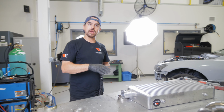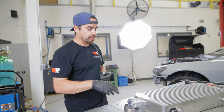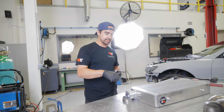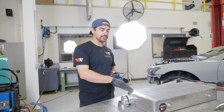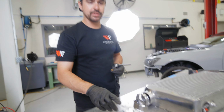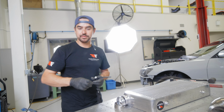All right, so we have the intercooler removed off the car. Since we're using HD clamps off the intercooler and the throttle body, what we just did was we cleaned the necks of the intercooler, because this was run before already. And now we're gonna be tacking on the HD weld ferrules on both sides. They're an aluminum weld ferrule to match the aluminum intercooler. And then the other side will be a titanium weld ferrule. We bought that separately from the assembly, and that'll be what starts the titanium 3.5 cold side intercooler pipe.